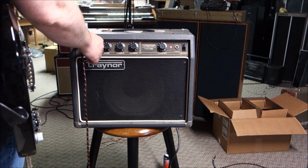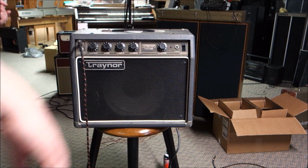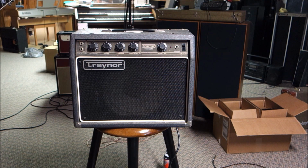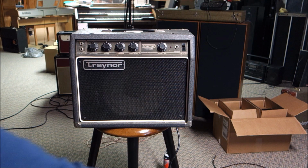Solid state distortion tone. I think that's probably usable in some lot or another. And we have another amp just like this that we need to go over. The treble hiss is kind of normal for these. There's a little bit of that, but the real low hum that we were getting from the filter caps is nearly gone. Nearly gone. There's still just a tiny bit there, but not enough to count.